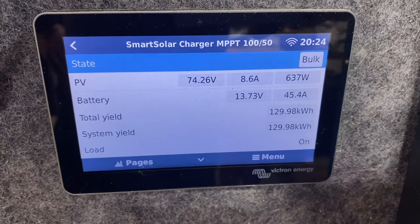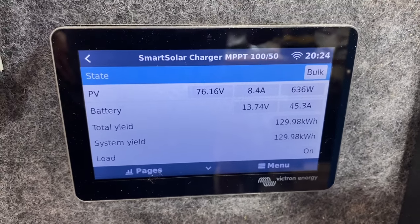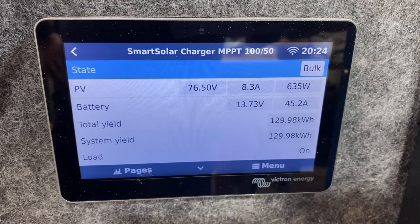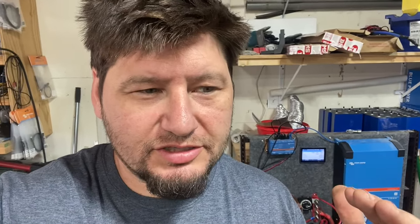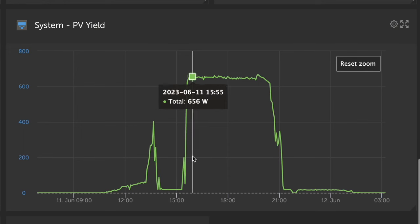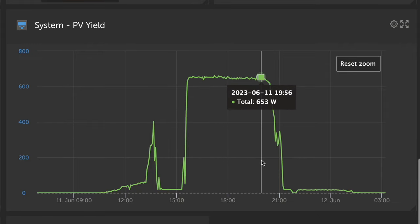Now a little further in the day and we're down to 45 amps. But still making great power, so that leads me to believe that this 900 watts or so is about perfect because we don't have a ton of clipping. In case anyone doesn't know what clipping is — that is when the solar charger reaches its max while there's still room above it where the panels could still produce. A little bit of clipping is just fine. You probably don't want to clip a ton because you're wasting potential capacity, but bigger charge controllers also cost a lot of money. So when in doubt I usually err on a little bit more solar rather than oversizing your charge controller. I've had customers with anywhere from 600 to 800 watts, but we haven't done too many at 900, which is what we're testing right there.